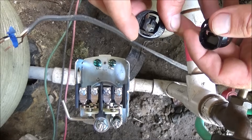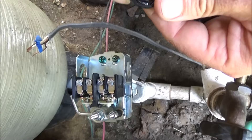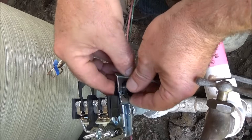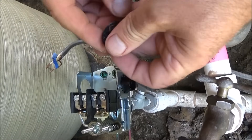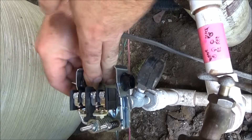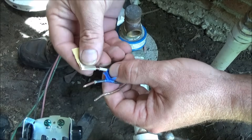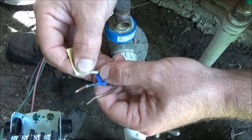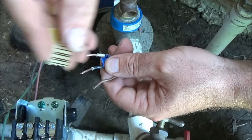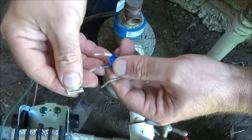The proper way to do your wiring anytime you have a junction box with a sharp edge is to get these little plastic inserts. You have to read which side goes in the box — it's sort of like a one-way valve so that the wire will only go in one direction. Then feed the wires back through. This pump is about 10 years old and has a little corrosion, so I'm using a piece of sandpaper to brighten up the copper ends before I make the connections.